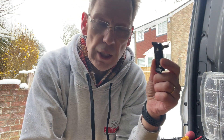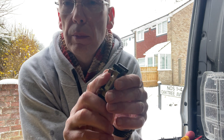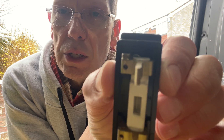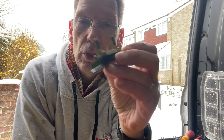Called to a property — the fuse has gone because the lights popped the fuse on it. Now with these ones, the colour markings on the front tell you what size it is. In this case it's a 5 amp because it's white. The problem is, it doesn't stop you putting any type of fuse wire you want in there, which can cause a bit of a problem.